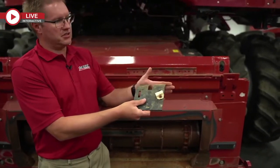One of the overlooked oil capacities is the unloading gearbox. This should be changed hopefully yearly, but if not every couple of years. There is a sight glass on the inside — a good thing is to use a mirror to check that sight glass every once in a while and make sure the oil is not getting milky. If the oil is milky, that means water is getting in, which means we may have a problem with the seal in the top of that gearbox.